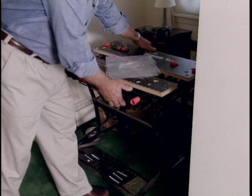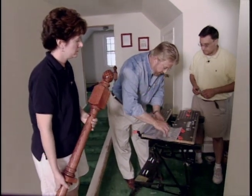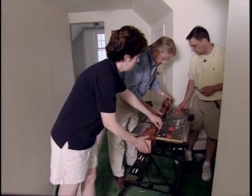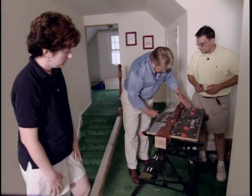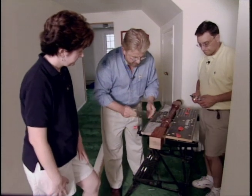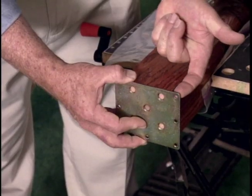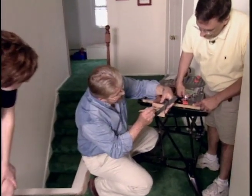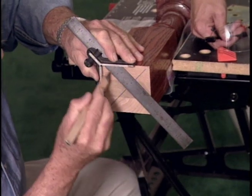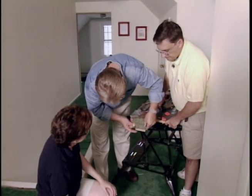Stacey, grab that newel post — we're going to get this ready to attach to the floor. These are just plastic food storage bags. I'm putting them in here to keep from doing any damage to that new finish we put on here. That's the bottom end right there. This is the top. Just tighten this up a tad. Now the system we're going to use to attach these involves the use of this metal plate. We're going to attach the plate to the bottom of the post — you see how it overhangs here and here — and then attach these ears to the floor. To attach the plate, we have to drill a pilot hole dead center in the bottom of the newel post. A special center finder attachment on my combination square makes locating the center as simple as drawing two diagonal lines. Next step is attaching this plate right here.